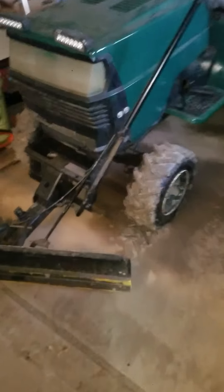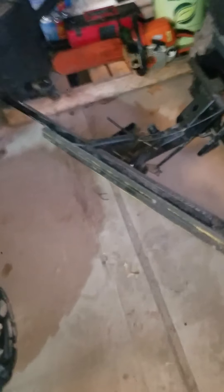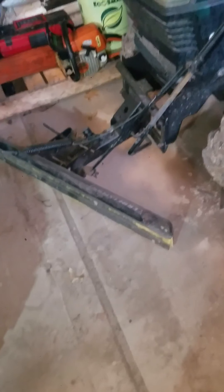With my accounts, we had to put poly edges on these plows because we ran into a problem with the association worried about us ripping up their paved walkways. Simple solution — we threw poly edges on. They cost about 50 to 60 bucks a piece and you usually get about two seasons out of them. This one hasn't been changed yet from last year and it still has life on it. So great setups. This is our backup now. Nice LEDs in the front to see, and lights in the back. Visibility is key, especially when plowing at night.